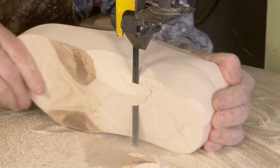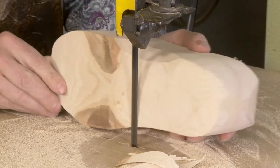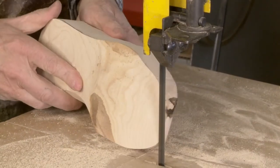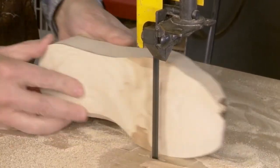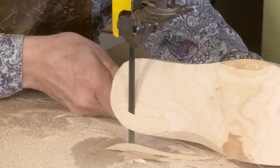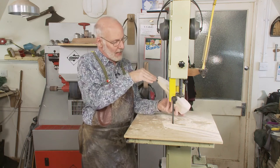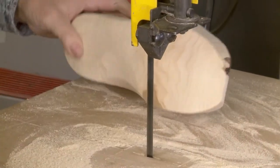The range and the arch support. The range is where the flat surface of the front is. That needs to be skimmed and round. So you see as I'm cutting, gradually the bark disappears because I'm making the crown, that is the round shape of the range of the front of the last. So it's curved in many directions. I'm also making it so when you look from the end, it looks straight, even though it's a dynamic shape.